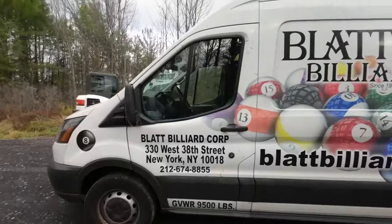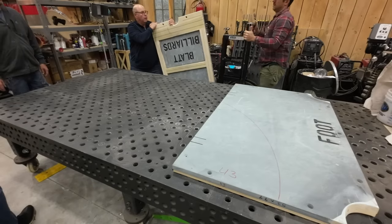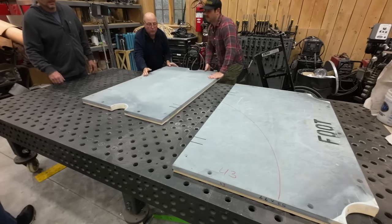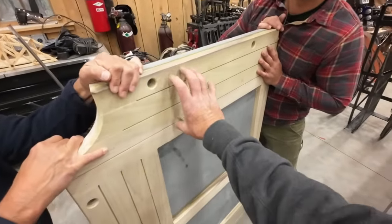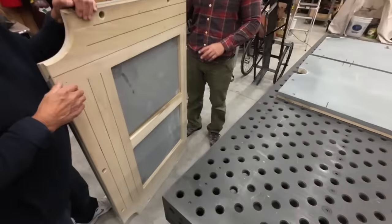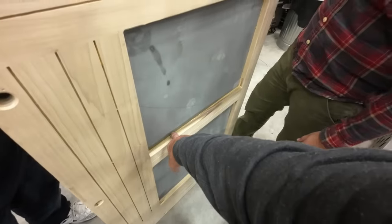Here we are in my shop in upstate New York and I'm getting my slates delivered so that I could build the table of my dreams. Each table is made up of three slates, and each one of these slates weighs about 200 pounds — that's why they make them in three parts, so that a typical pair of tradesmen can carry them into a house. Each slate has this wooden back in poplar and it's glued directly to it with Titebond. The wood is sliced up so that when it shrinks and expands it doesn't pop off. The slates come from South America and at Blatt they customize the back of them and install the wood on them.